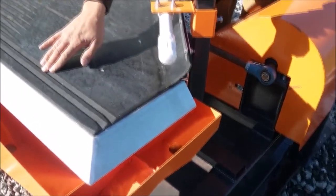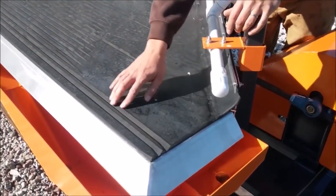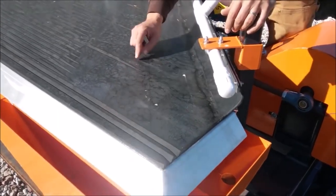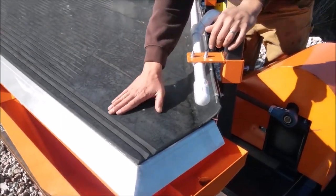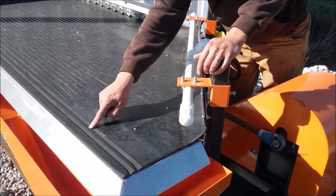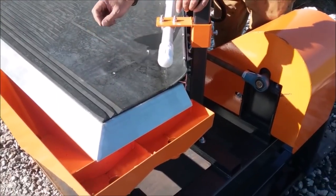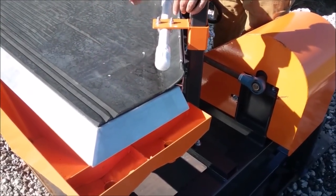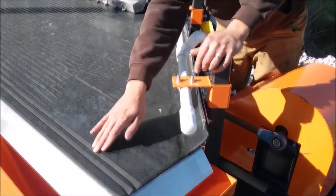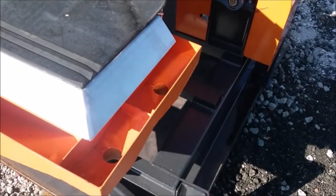At the edge of the shaker table there are two grooves that run all the way across. These are called our safety grooves. If any material reaches the edge of the shaker table, it's captured by these safety grooves and comes across this way. We've seen round materials like spheres roll down and be caught by these safety grooves, so that's an important feature of our table.